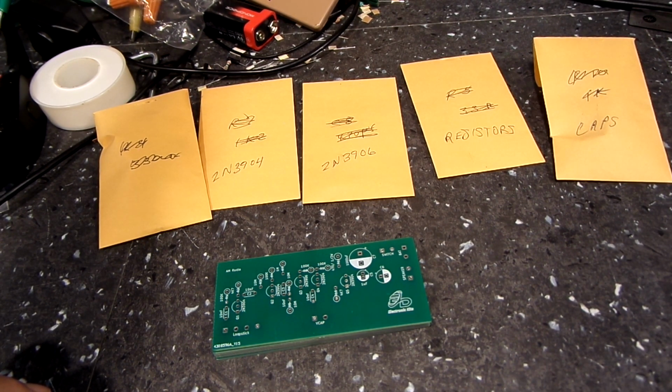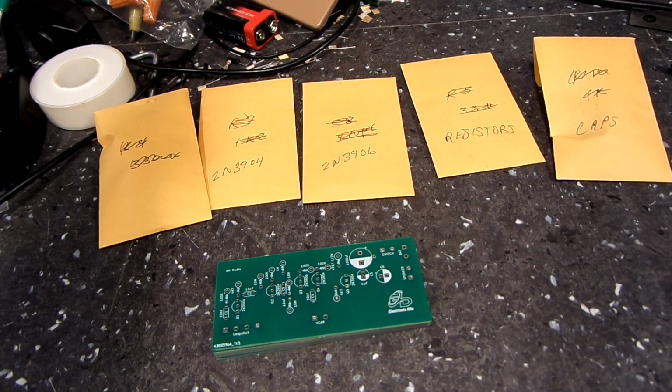Of course, now we won't be using the 60 picofarad section of the standard VCAP, which is the oscillator for superheterodyne radios, but the rest of everything else is pretty much the same as the Magnavox that I just showed you. It works the same way, except the only difference is where it inputs. It's inputting to the RF amp, and there's no oscillator with it because it's TRF. That's why the 60 picofarad section is not used, because we don't have an oscillator. So that's the way it's going to be working, I do believe.